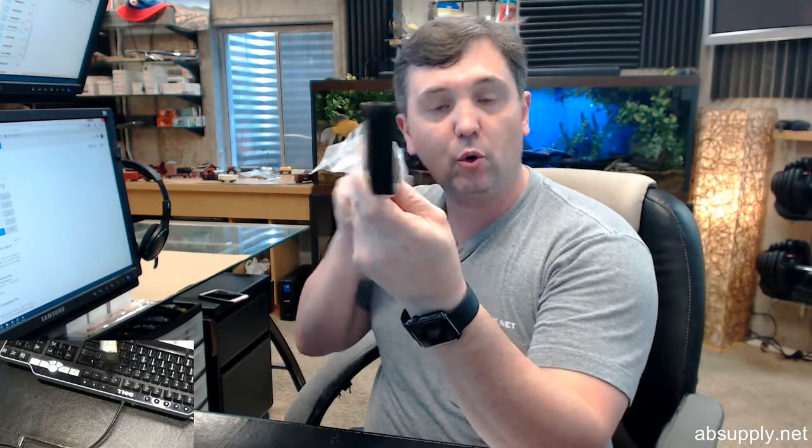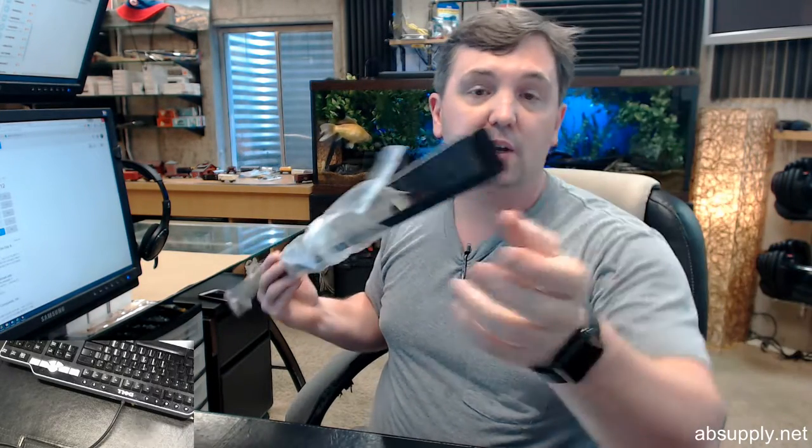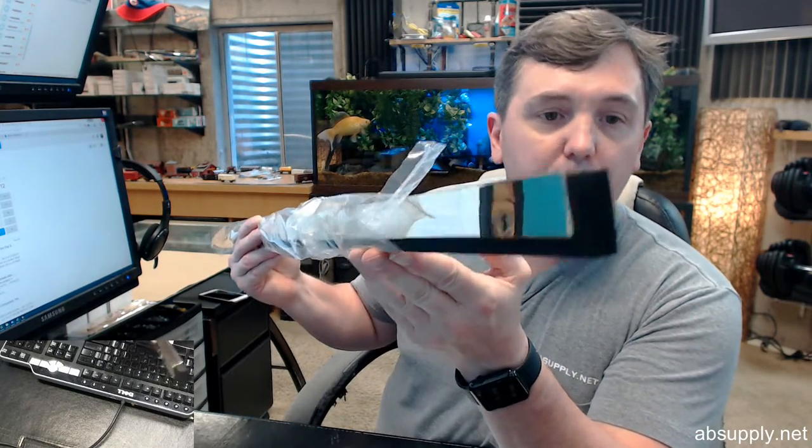Okay. Now the 82 stands for this profile. So when you order an 82, it's going to look like this. The B stands for the base material. That's solid architectural bronze. Some people will call it brass. It's technically an amalgamation of four primary base materials. It's okay to call it brass. We're going to call it architectural bronze because that's what the industry will call it. But that is the material that you'll use when you are doing solid brass hardware or solid bronze hardware. It's an amalgamation of different base materials. The N in the part number stands for neoprene.